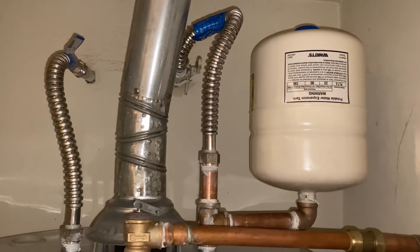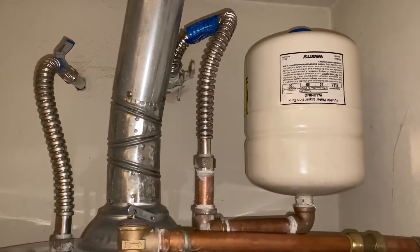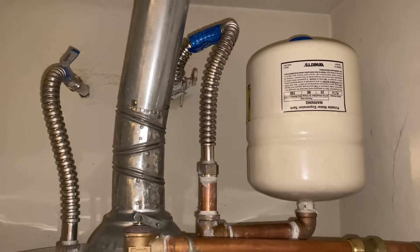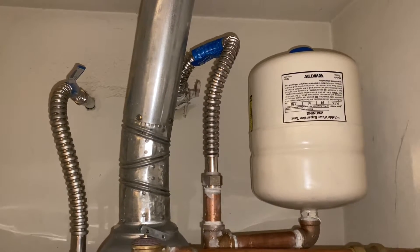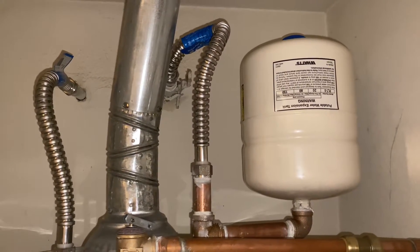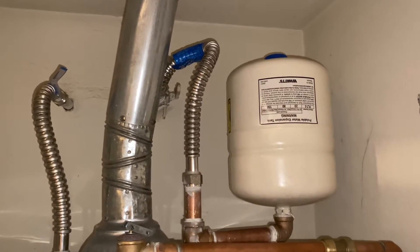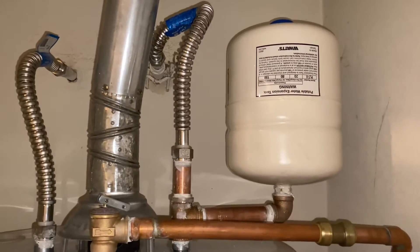But you've got to pressurize it. In my previous video, I'm showing you how to pressurize the water tank. This is a pressure tank — there's no water in it, it's just pressure. You have to regulate it with your water pressure at the water regulator outside by your shutoff valve from the street coming into the house. That pressure regulator was set at 58 PSI on mine. This tank comes from the factory at 20 PSI, so you have to pressurize it — check that previous video.